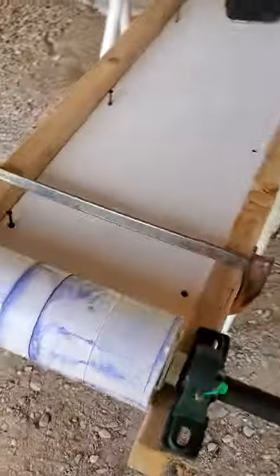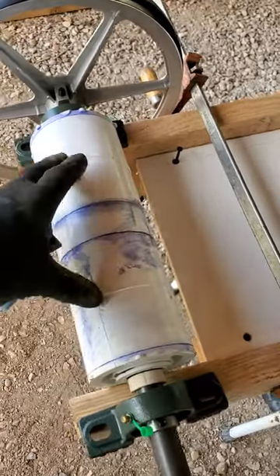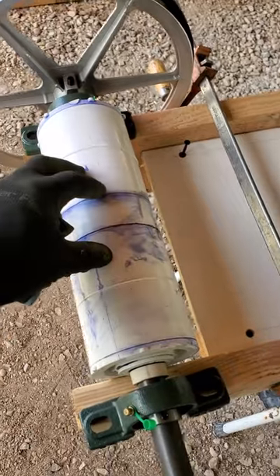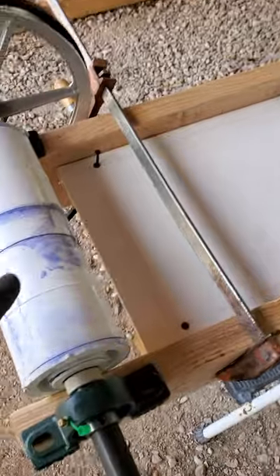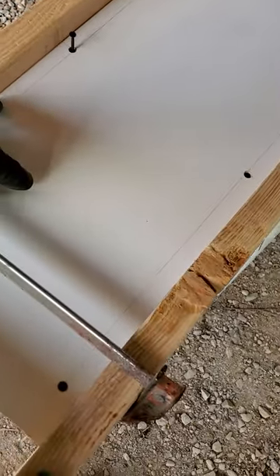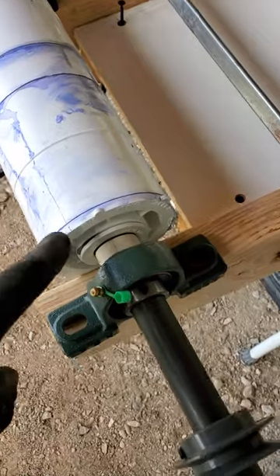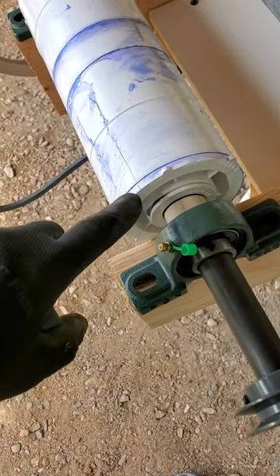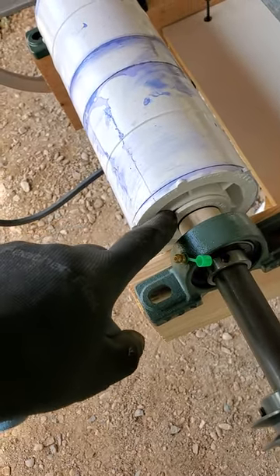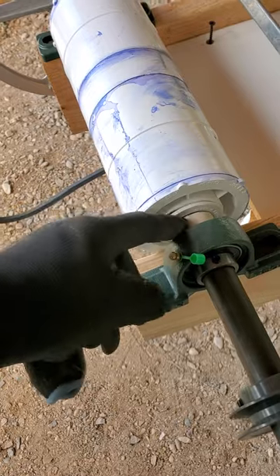As far as the mechanicals go, this is as far as I've got. This drum consists of three-inch PVC pipe couplers — two of those — and then a sliver cut from one in order to give it the correct width. My belt material is eleven and a quarter so I've made this eleven and a half, giving it only about a quarter inch total clearance as the belt slips up here, and I'm hoping that's enough. This is a socket that goes inside the pipe coupler — three-inch down to inch and a half — and inside that I have another socket reducer which goes inch and a half down to inch.